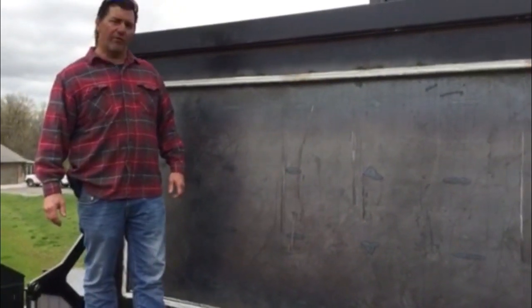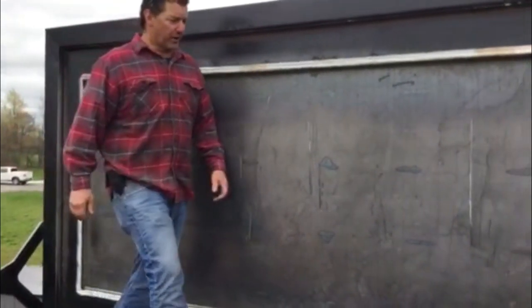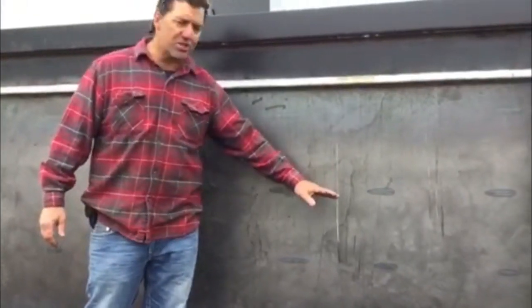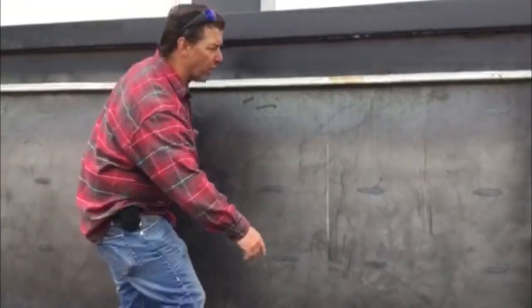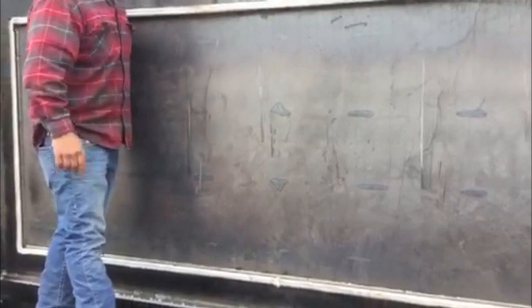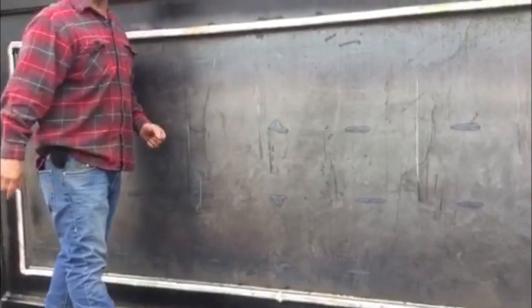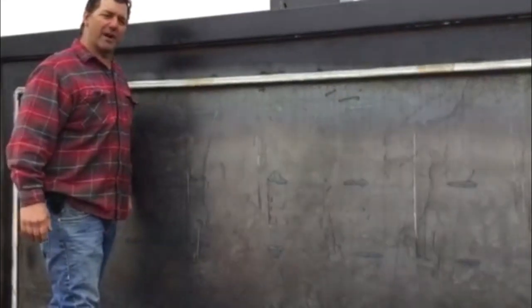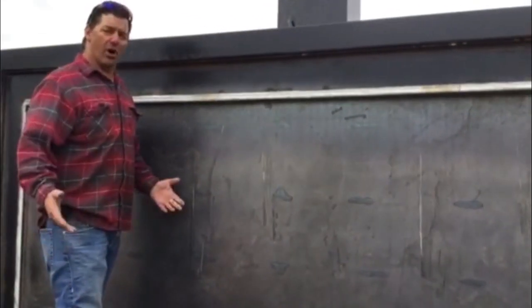We move our water through the boiler and we actually put partitions in here. There's 10 partitions, so we're forcing the water to go through and cover every square inch of the lid, including the boiler. We're moving water around every square inch of the boiler all the time to make sure that we don't have migration and we're utilizing all of our water.